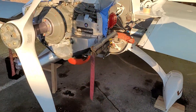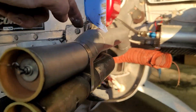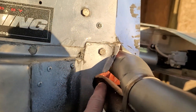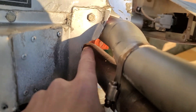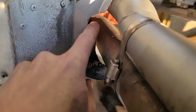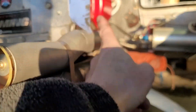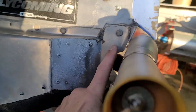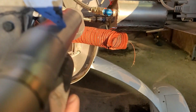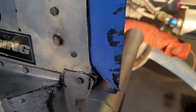At the business end of the airplane, I did get this new exhaust in place and it's ready to go. I pulled out the old oil breather tube from here. This baffle is still cut out, so I used some cardboard-aided design to cut out a piece that's going to fit in here. I'll go home and cut some aluminum baffle material to fit that. We'll fit that in there when we get back, probably tomorrow.